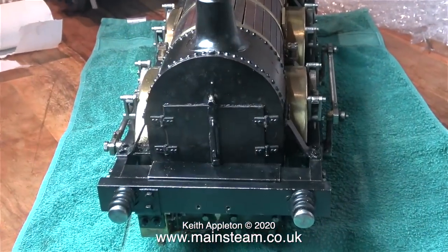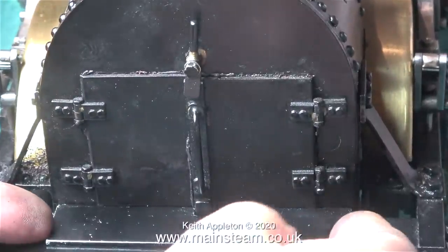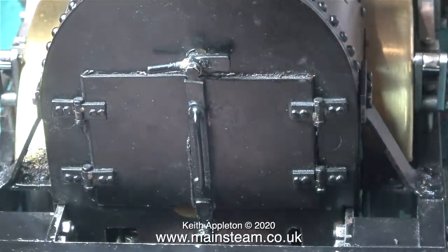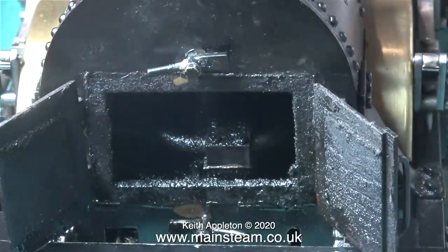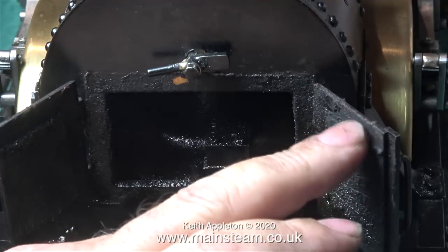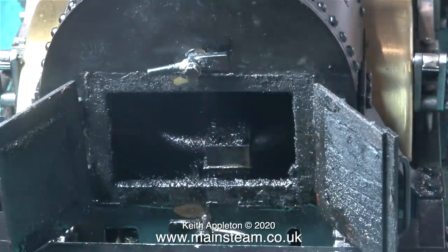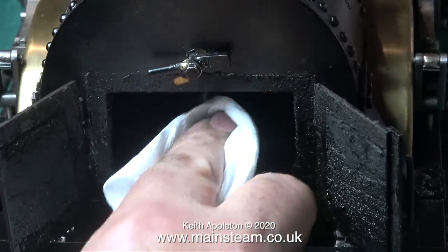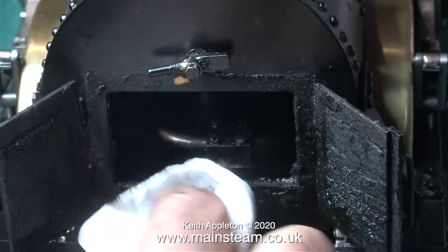Here's a front view of the engine — it doesn't have a normal smoke box door. Steam engine design has changed quite a bit over the years. This has two doors that open up with a couple of latches at the top and bottom. So you open the latches, then open the doors to have a look at the mess inside the smoke box — a combination of steam oil, soot, and some ashes from the last firing. After the last steaming, Lee must have put a lot of oil through the engine. There is a YouTube video of this engine running around the Ermston track — the link is in the description. I'll take this opportunity to wipe away some of the oil and soot from inside the smoke box.